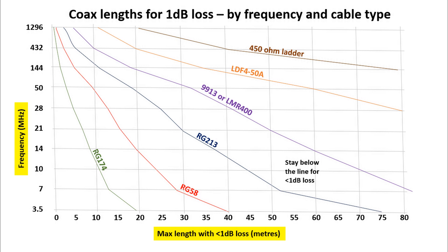There are other things with coaxial cable too, like power handling capacity. Generally speaking, the thicker the cable, the more power it can handle. RG174 wouldn't handle more than QRP power. RG58 is okay with around 30 watts, possibly 100 watts, but you wouldn't run a kilowatt through it — you'd go for your thicker types for that. But the main thing with coax is keeping loss below your threshold, and when you do that, you'll have the best possible signal from your station.